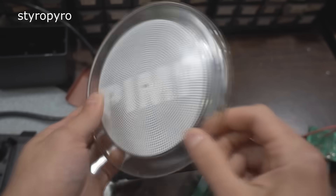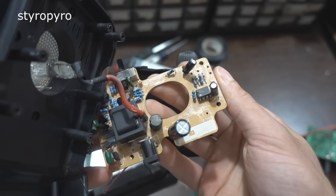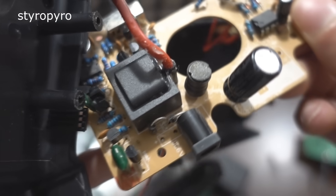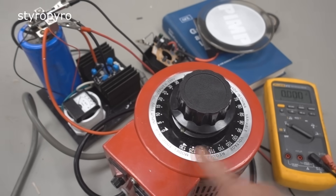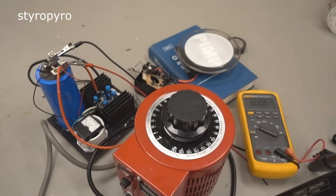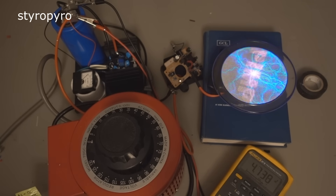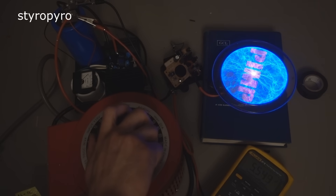If I was lead engineer on this project — of which I'm totally unqualified for — I would design this thing to use the max amount of power available on a typical household outlet, because anything less than that is a wasted opportunity. So how do I make it better? I noticed that on my unit, even though it only runs off 6 volts, the components inside are actually rated to a minimum of 15. So if we disregard all the other ratings like current or breakdown voltage in the transformer secondary, this thing was basically made for higher voltages. This is what the testing setup looks like: I feed power into a variac which gives me adjustable AC voltage, send that to an AC-to-DC converter, and feed that into the plasma lamp. Let's give it a try. My setup isn't a total failure. Let's bring it up to its original voltage. That's about where it's supposed to run — I swear it already looks brighter.